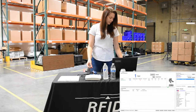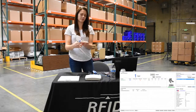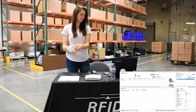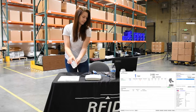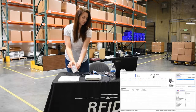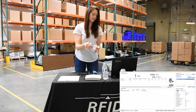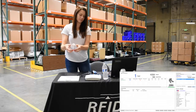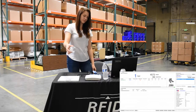Go ahead and stop that inventory and clear your list. Now we'll test it using a full water bottle. Place the tag on the side of the water bottle and click Start Inventory. As you can see, with the tag pressed directly up against the full water bottle, the max height is a lot shorter than it was for open air. Now try it with your empty water bottle — you'll notice how it goes up almost to the same height as the tag just in open air.